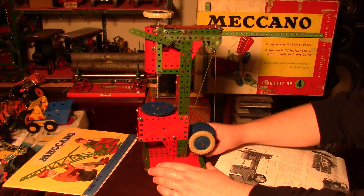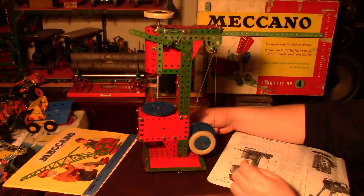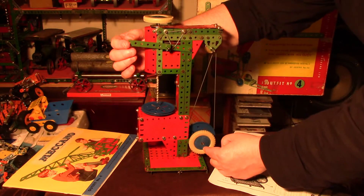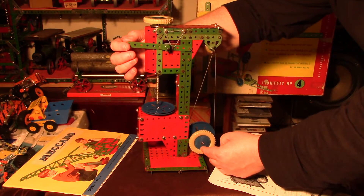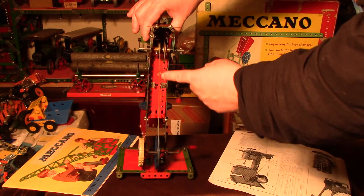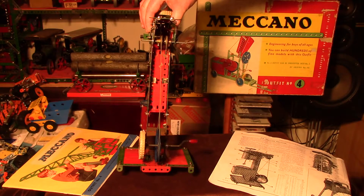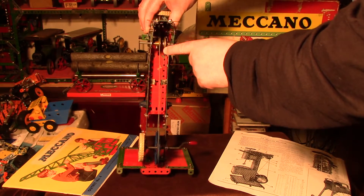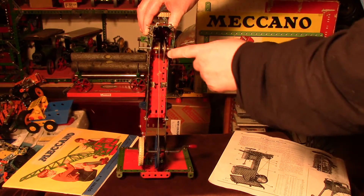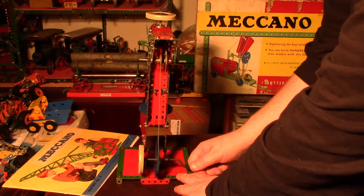You operate the drill while bringing it up and down as needed. Hopefully you can see some of the mechanism here. We've got the three-inch pulley with the drive band coming up over a one-inch pulley — that one's fixed on the axle and goes forward into the head. The belt runs round the pulley in the head, comes back, and runs over this other pulley which is loose on the axle but held in position by spring clips and, in my case, some added washers. It then goes back down and round the three-inch pulley, driving the drill.